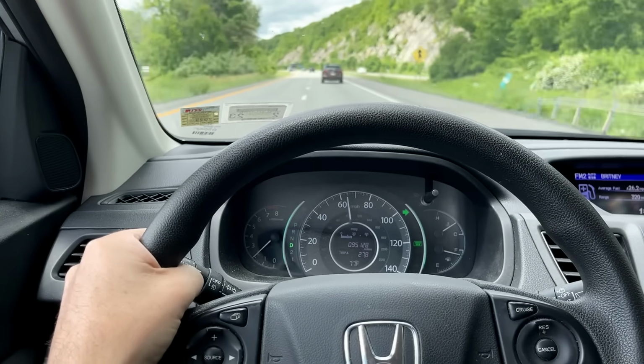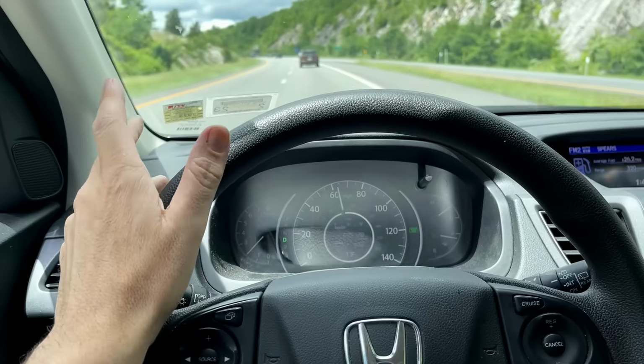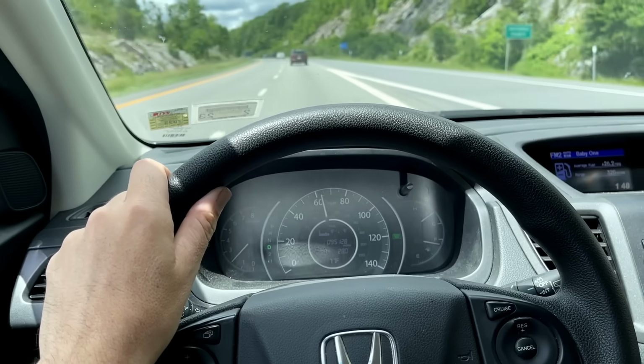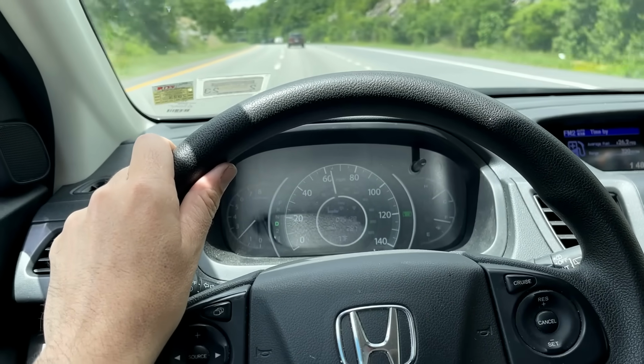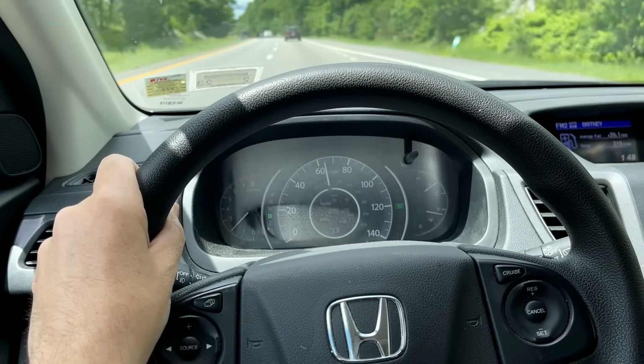In case you're wondering, that's 6 gallons of fuel. It is now in my car. That's usually how I get rid of old fuel. I've never had an issue with it. As long as it goes through the coffee filter without clogging and there's no water in the fuel, mixing it with fresh stuff in the car tank, I've had no issues with.